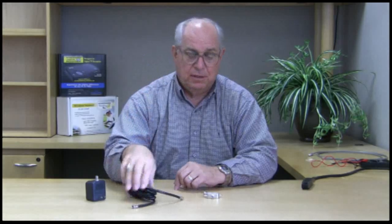Today we're going to troubleshoot a PS 1503 power supply, which is used with our preamps and amplified antennas, to make sure the unit is working properly. The PS 1503 consists of three parts: the plug-in wall transformer, the six-foot cable that comes packaged with the unit, and the little splitter-looking device referred to in the instruction manuals as a power injector.